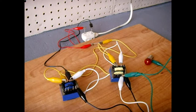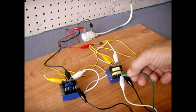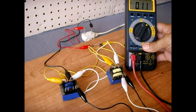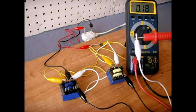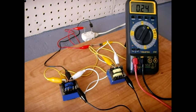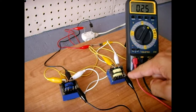Just as long as you remember, the most important thing is they must be nearly identical before you do that. Now I'm going to remove this bulb, take it off the secondary that's doubled up, and put the meter back in position. I'm going to remove the other jumper that connected the left pins together, place them back, and now I'm going to show you that if you reverse the two leads — the line in and the neutral — how it changes how the current flows through the winding.